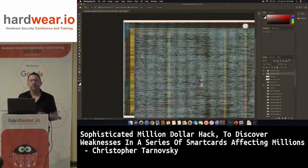So there are things that you could do, but this chip runs on its own internal clock. So you'd really need a needle for the clock source, and then you'd need a needle to do the glitch. So that'd be 2 needles you'd have to put down. But that's not hard. 5 needles is usually about the max I use. And that's a worst case situation.